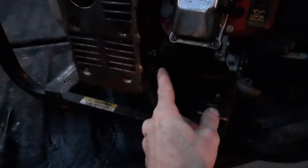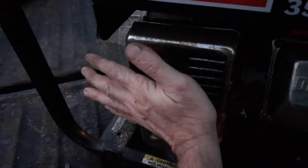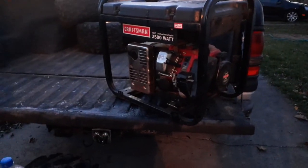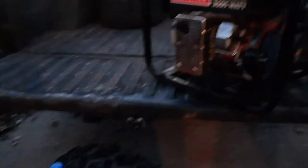Get a new oil filter, fix the cutoff switch for the oil, make sure it's good, new spark plug — couple things — put some wheels on this bad boy and we've got a nice little generator. It's a little loud but most generators are. There wasn't that much smoke out of it either. I was thinking it was going to need a carburetor but it fired right up on one pull. I was standing right here, held the top and just pulled — turned right over. That's incredible.